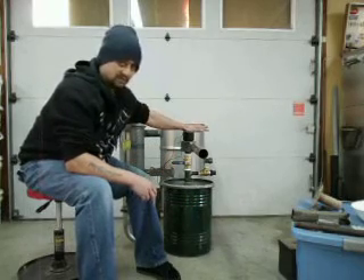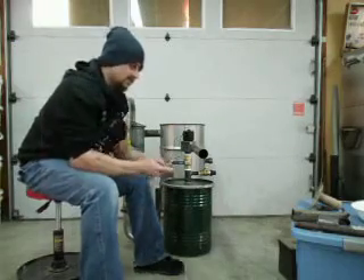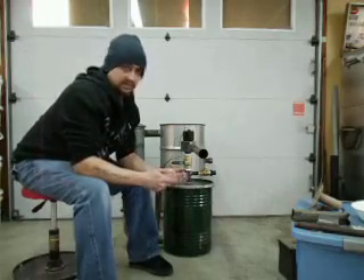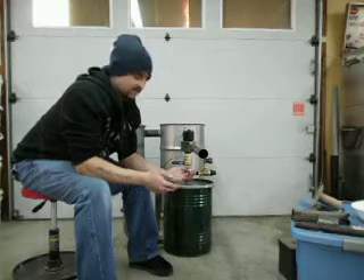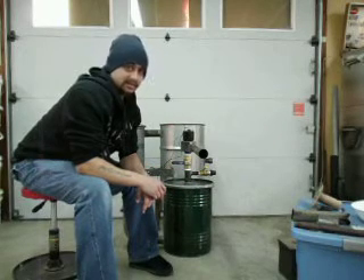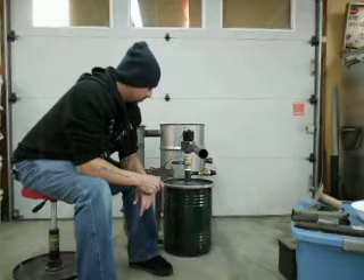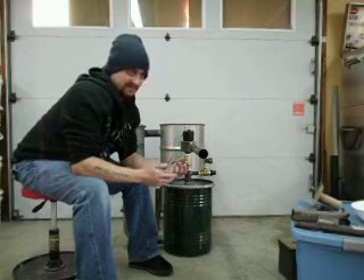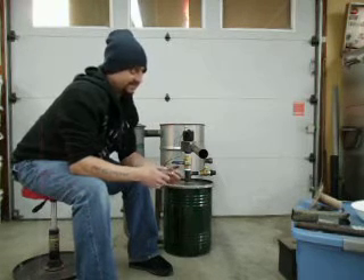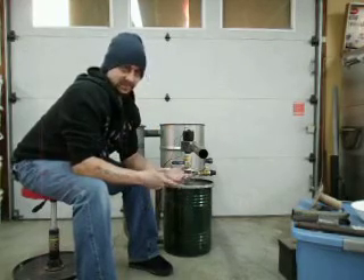The gas is being pulled by the fan, so it's under a vacuum and it's being pulled up through that sawdust — and that sawdust is your filter media. I change my sawdust about every five hours of run time or so. Not because it's ineffective — it was still working at the time I changed it — but I have an incredibly large amount of sawdust available, so I just change it frequently.